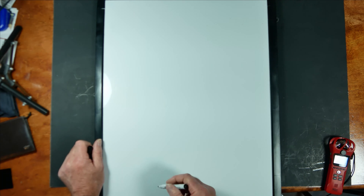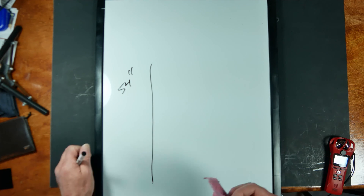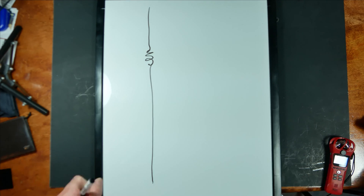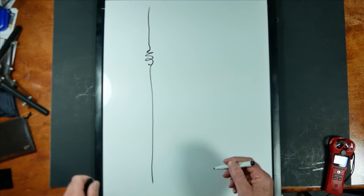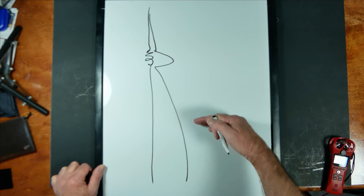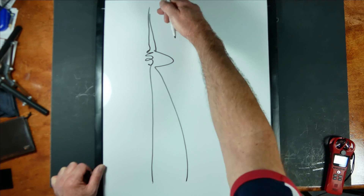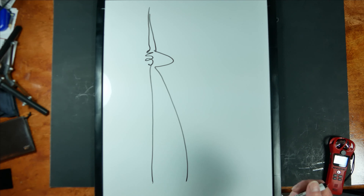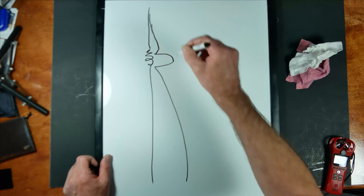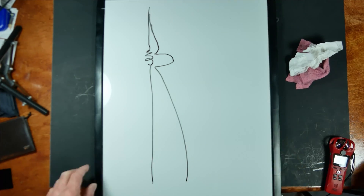If we wanted to build a vertical 6-meter antenna, that antenna would typically be about 54 inches long, but in my case that's not going to work. So instead, what we're going to do is make it longer — which seems counterintuitive. But if you look at the current pattern, there's a quarter wavelength of current pattern at the bottom, a half wavelength in the middle that's also out of phase, and then another section — it's only 33 inches on the stinger, so less than a quarter wavelength. It's a true co-linear because there's more than one current pattern on the antenna, and it should work just fine.